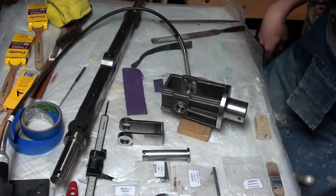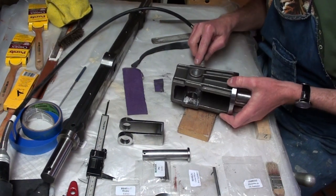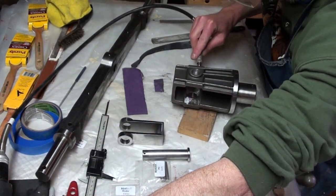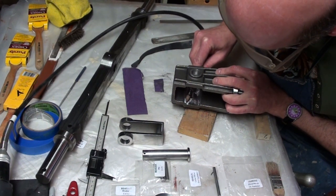We were careful to place the part in the vise to be sure there was no significant force at the weld points between the top plate and each side plate. This was done several times, each time releasing the pressure to check the distance between the sides, then repeated with a bit more pressure until the sides were parallel.